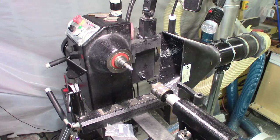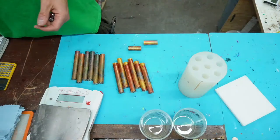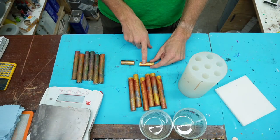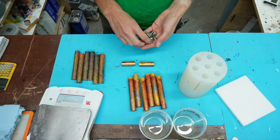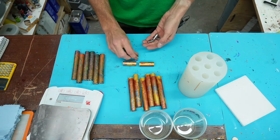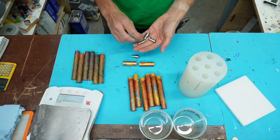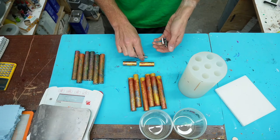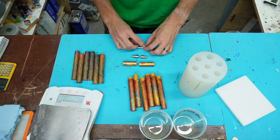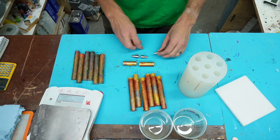This'll work better if I go over here real quick. I've got to lay these out so I make sure that I put the bushings in the right order. Okay, so that's the front. I'm going to switch over to this other view so you can see what I'm doing here. I like to lay them out. The longer one on a cigar kit is the front, the nib, and then this is the clip side. The biggest two go together, and I think the smallest one goes in the front.